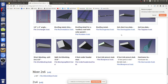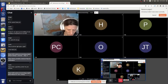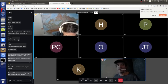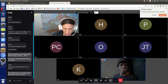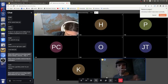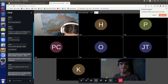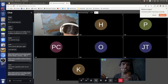So you have to say something like, in this design, here's the way we look at it, from the front, let's say. The convenient thing is, you're looking at this object that you're building, so define a coordinate system based on the natural physical look of it. If we're looking at the house from the front, define XYZ equals 0, 0, 0, like in the Cartesian coordinate system, at the bottom left corner. Everything's zero there. So that's one way to look at it.